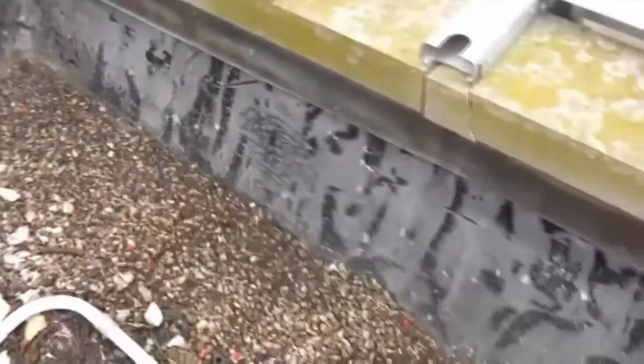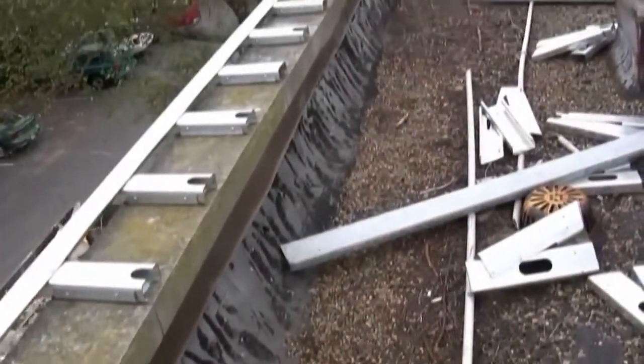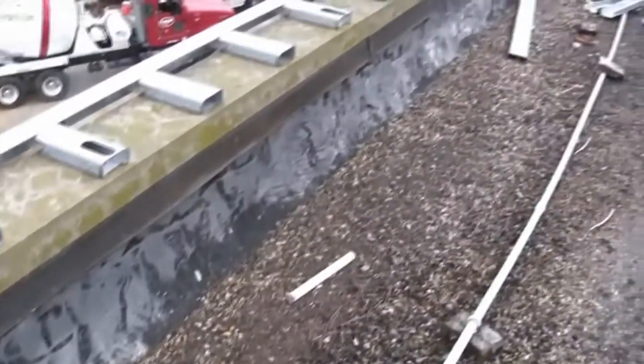Here we're looking at the sides of the parapet wall. There's a sheet that was laid up — probably a layer or two of just raw asphalt paper when it was installed. As you can see, it's just got holes everywhere. There were probably 200 holes ranging from the size of your fist down to the size of a dime or a quarter all the way around the parapet wall. So we know that water was getting in there every time it rained, especially in a torrential downpour — just cracked with holes all over the place.